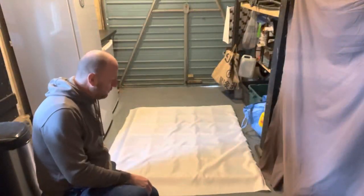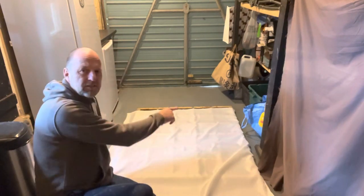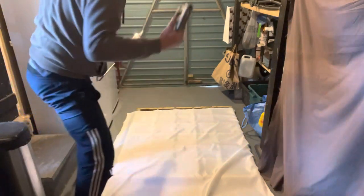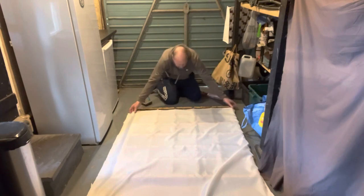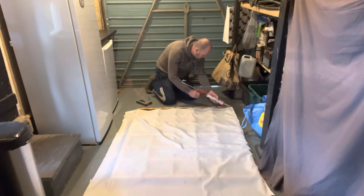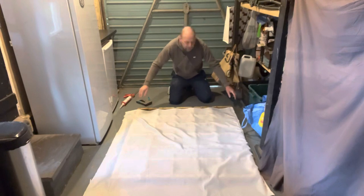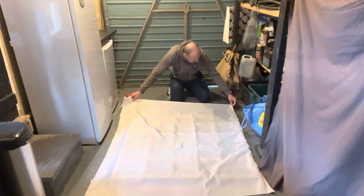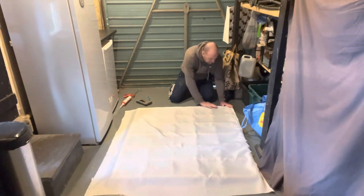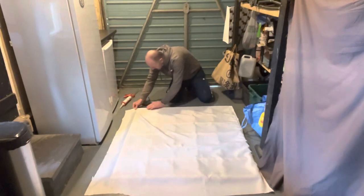Okay so what I'm going to do — I've already cut this roughly to size. I'm just showing the top side of the curtain there. I'm going to get the silicone, run the silicone along and then staple it. Get this curtain lined up a bit better, and I'm going to run a bead along the top here. You don't want it oozing out everywhere, so just a little bit. Then what you're going to do is pull the top of it onto the silicone, and once you get it in place rub it down. Make sure everything is in line — rub it down. You can see when you rub it down it's stuck to it.